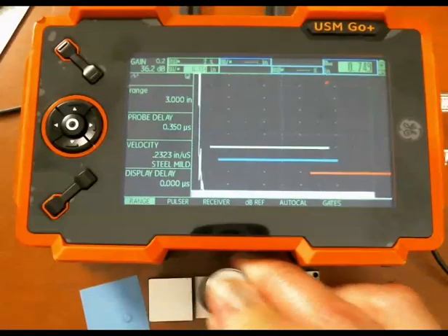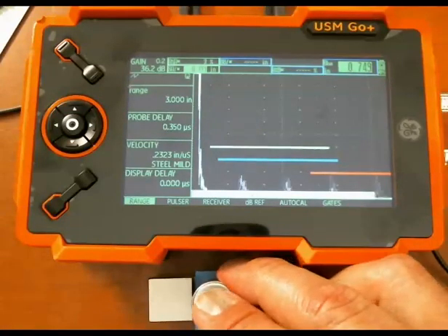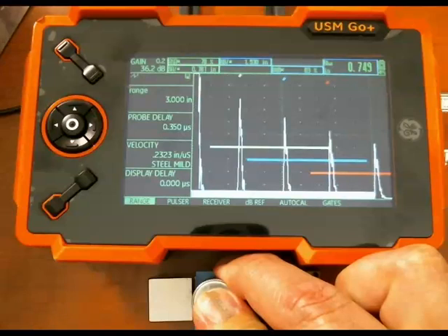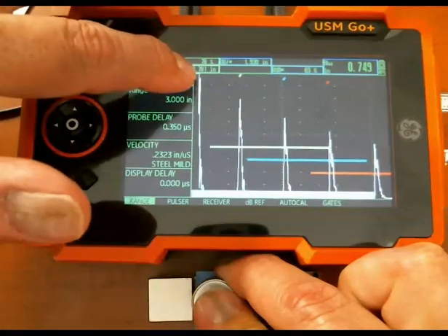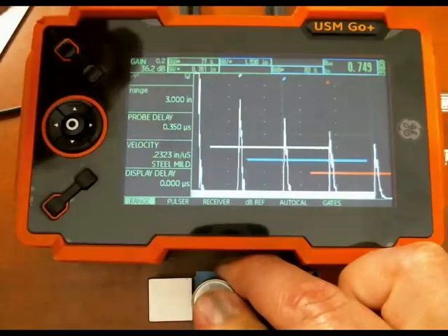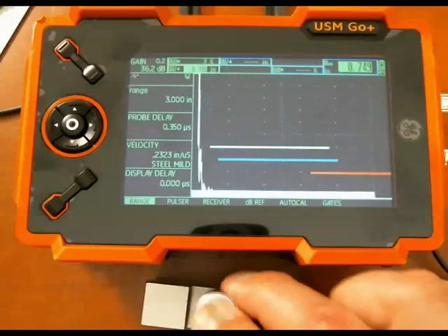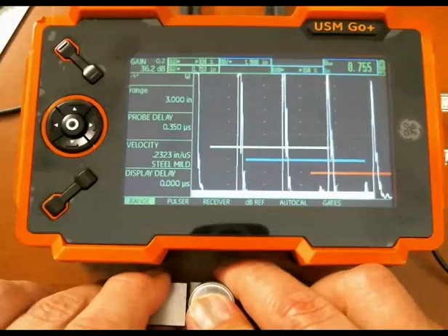I have a little piece of plastic here, about 10 thou thick, and we're going to use that to simulate a coat of paint on that three-quarter inch block. When we look, our distance in A is now 781 — we grew a lot in thickness because the plastic shim is about one third the velocity of steel, so we effectively added 30 thousandths of steel thickness. Gate B also shows another 30 thou, around 1.530. But our difference — our SBA — is still 749. With the plastic in there, we're measuring 749. Take the plastic out: still 749, 755.